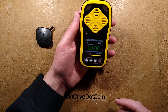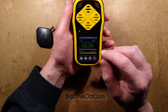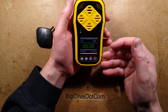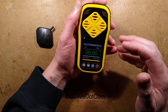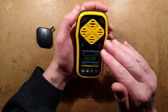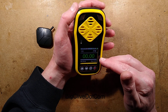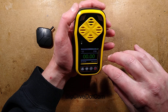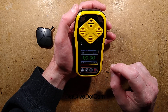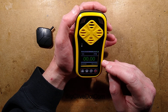At the moment it's displaying zero. This measures ozone in parts per million between 0.00 and 10 ppm — it's quite a sensitive meter. The resolution is such that it spends a lot of its time at 0.04 and then jumps up to 0.06, but it fills in the digits in between by counting up in software. In reality it goes between values like 4, 6, 8, 9, 11, 13, 16, 18, 20.